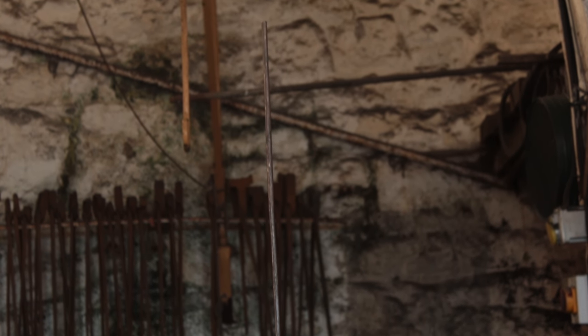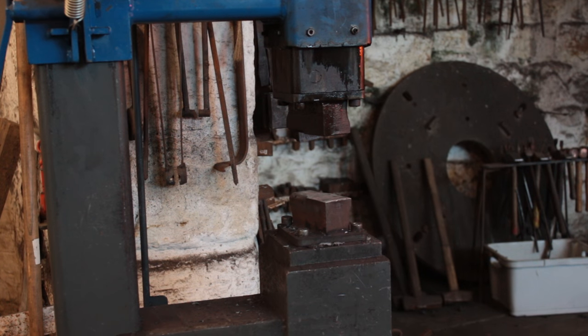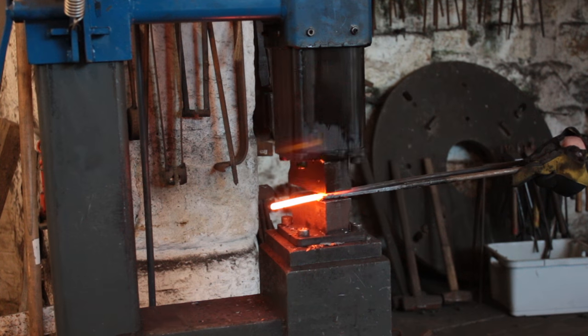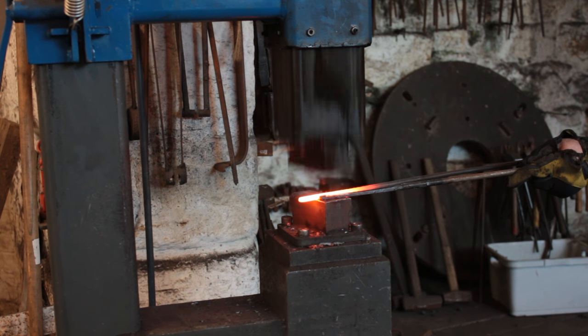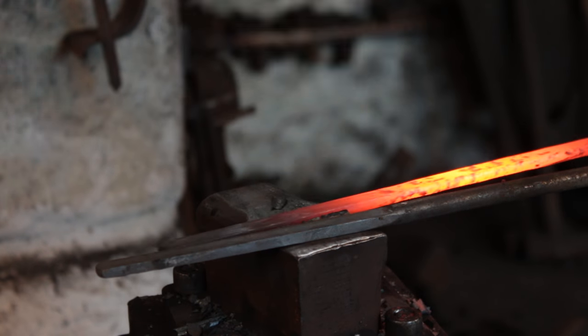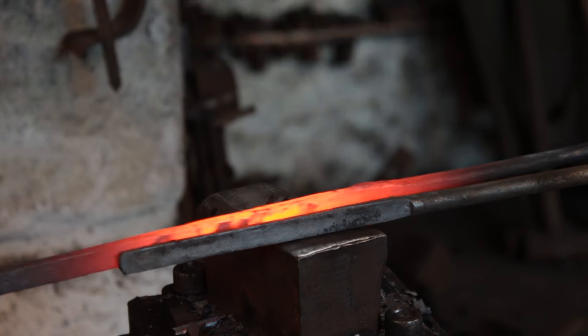As you can see, those ten inches of inch-and-1/8 drew out quite long when reduced down to three-eighths of an inch. That three-eighths I will then go under the power hammer again and flatten to make a flat section. I've made a stop for the power hammer for accuracy — the stop is the correct section, and I'll just flip it 90 degrees to dress the three-eighths to the correct size. That lengthened the bar by another nine or ten inches.